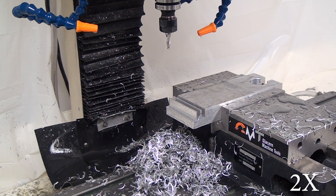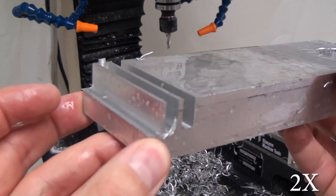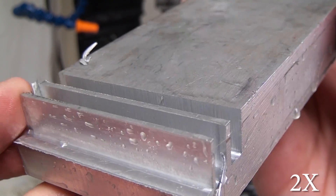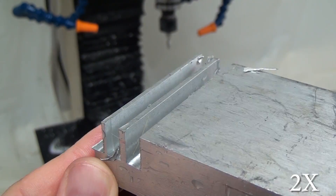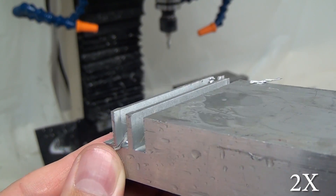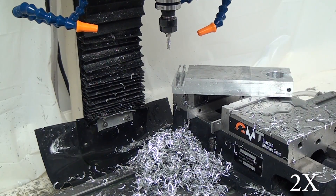The wall finish looks really good. There could be some deflection going on, but it seems like a pretty rigid end mill with that 3/8 shank. I have tried larger end mills in the same variety, but I've stopped buying end mills over quarter inch because my machine just isn't rigid enough to run half inch or 3/8 shank mills in my opinion. Anyway, that's it for this video — check the links in the description, hit the like button, subscribe if you haven't, and thanks for watching.